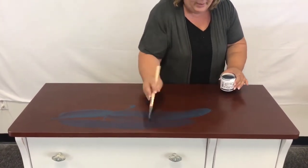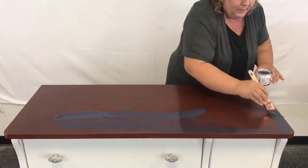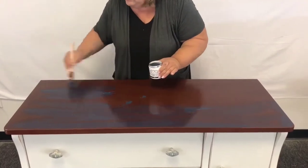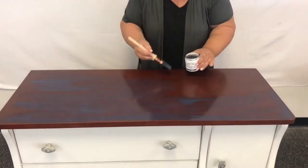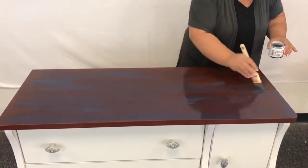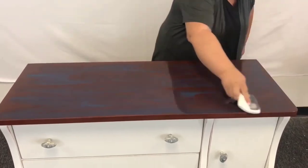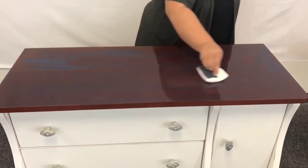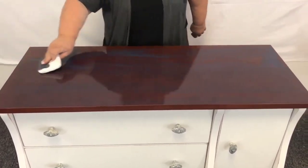As you apply coats, they get deeper, and they really enhance the look of the furniture. You stop when you want. If one coat is all you want, just put one coat on. It dries in 20 or 30 minutes tops, especially if you have a fan on it. We're smoothing out this second coat, and two coats is all we're going to put on this because it really made the wood look beautiful, and we're through. If you put too many, you'll lose the wood grain, which you don't want to do.